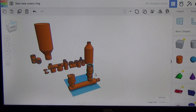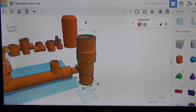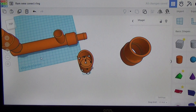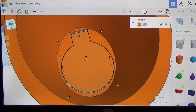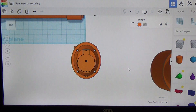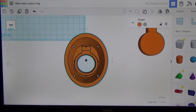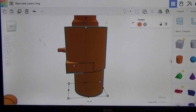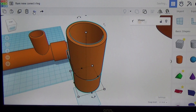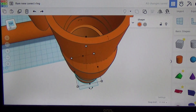Here we have the one-way valve system. Let's pull that off as one piece and take a better look inside. This has got a couple of pieces — a top cap piece that goes over it, which allows us to get down into where the valve is. We can stick the flapper down in there once we 3D print it, making it a lot easier to assemble. You can see the one-way flapper valve right here — a very simple little piece. You can see the cutout in there for the flapper valve to sit down into. It's got a little pin hole to the side that allows you to stick a pin through to keep the flapper valve in place. So once again, we put the flapper valve back in, put the top back on, and that's a full one-way valve ready to go.